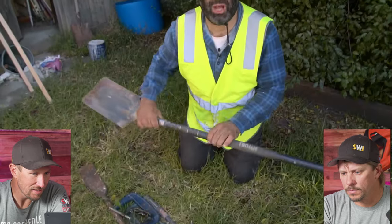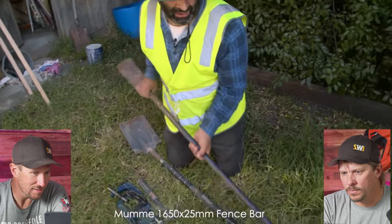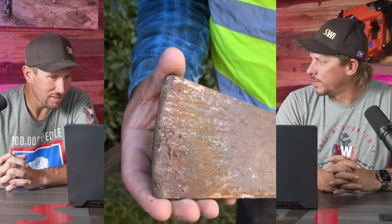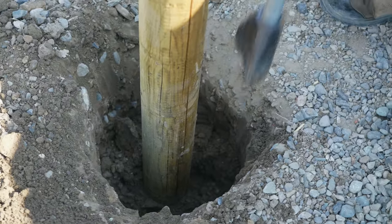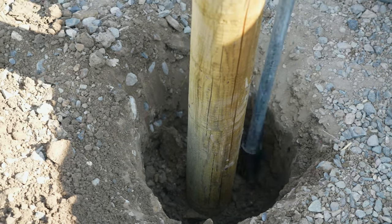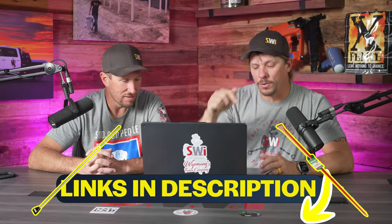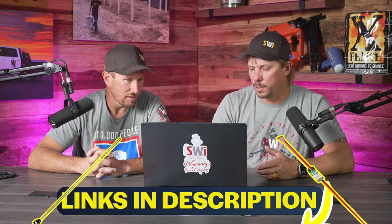Today I'm going to be showing you the right way. You need a shovel, some vices, a hammer, and this in particular — it's called a pinch bar. You can get a thinner one; we call it a tamping bar or digging bar. That's the tamping end. What I like for tamping is the new post rammer — it's amazing. And you've got the fencer's crowbar to go along with it, with a nice kidney-shaped foot for getting around round posts. Link down below.